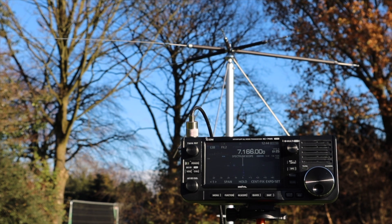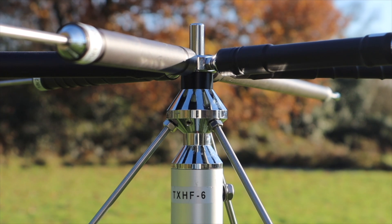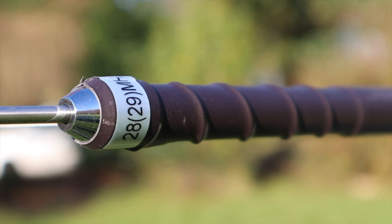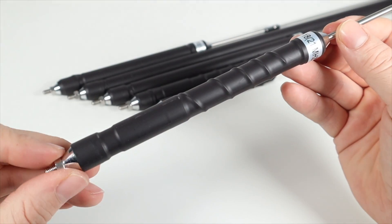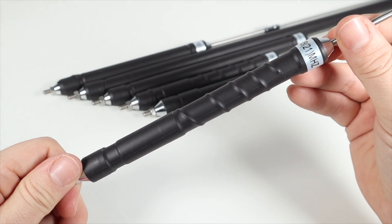The manual does indicate that this antenna can be mounted outside, but I wouldn't do so without some proper weatherproofing first around all connections and joints. This is quite an intricate antenna with lots of connecting parts, and water ingress can cause problems. I've mounted mine in the attic — not the most ideal place, but for receiving, which is why I got it in the first place, it does really well. I achieved really good results using this antenna, and it's a great way of getting on the HF bands without a lot of space. Compared to my wideband long wire I have outside, this receives nearly as well, which is impressive considering it's in the loft.